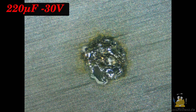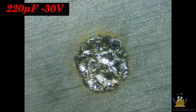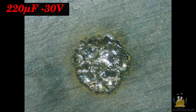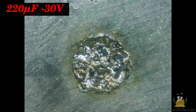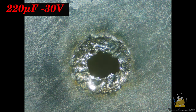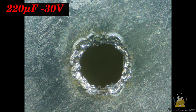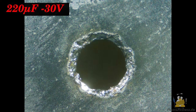In the previous video, I showed that sparks do not affect both electrodes in the same way. So let's change the polarity next. Now there is ground on the workpiece and the plus 30V line runs to the 1mm drill. 825 shots are now required for drilling, which is clearly more than with the original polarity. It can also be seen that the grooves on the metal surface of the razor blade are disappearing. Light grey deposits are forming here.